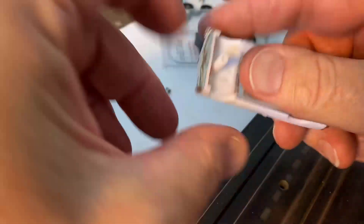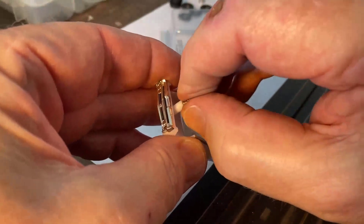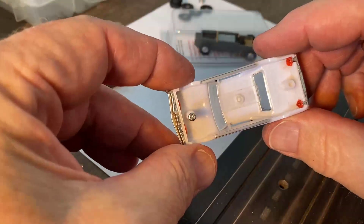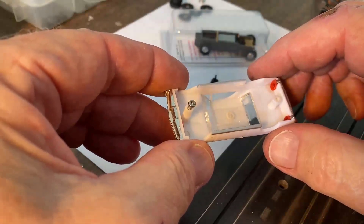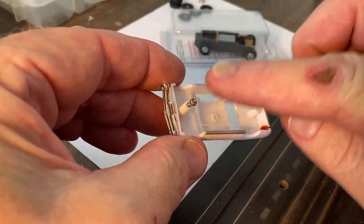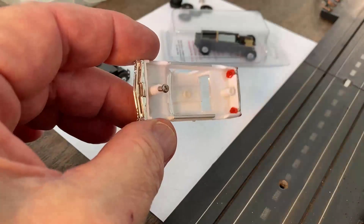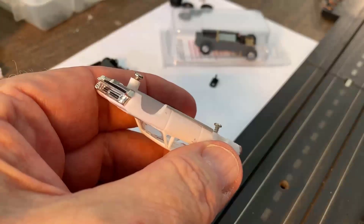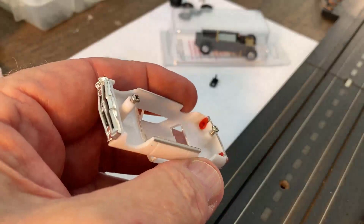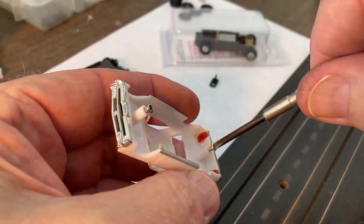You can finger-tighten it to start, but when you screw it down, go an eighth of a turn, a quarter turn, then back it out, go a little further, back it out — do not just drill straight in. Go in, back it out, go in, back it out. That is the right way to do it. You'll have good threads and you will not crack the screw post. Just take your time. Got the front one done — that's plenty far enough.